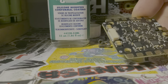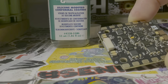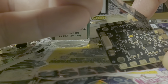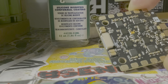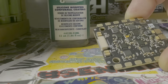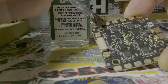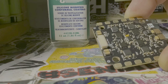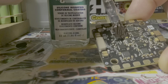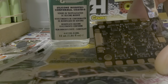This is pretty easy to do — if you've ever painted fingernails it's pretty much the same thing. You want to put it on all the components. If there's a pad you plan to use, don't paint those pads, but I'm not using anything on the bottom except for that connector, so I'm painting across everything here. My brush is a bit stiff from use but it'll still work fine. I put lots and lots of conformal coating on — I'm very generous with it, making sure it gets into all the little nooks and crannies on all the components and all their sides.